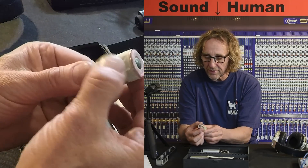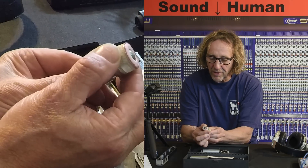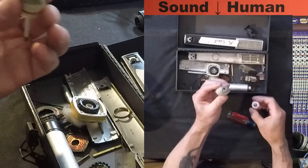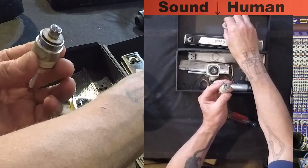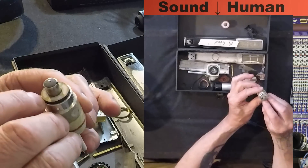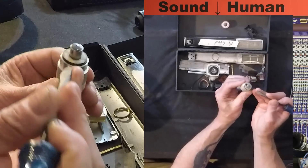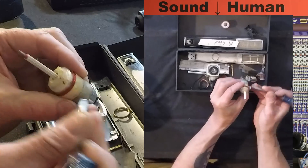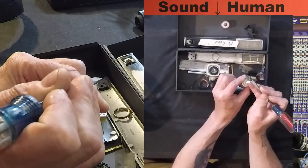There are actual screws that allow you to replace the diaphragm on this — you can remove it. Look at that — there's our diaphragm. Removable, replaceable diaphragm. And there's the magnetic pole piece with rear venting covered by resistive nylon meshing. You can see the magnet's very strong. There's a longer port which I believe vents through this flexible tube here.